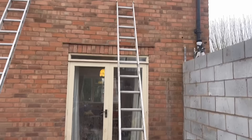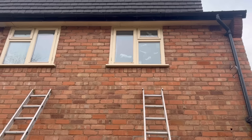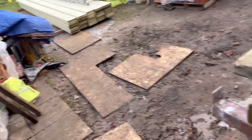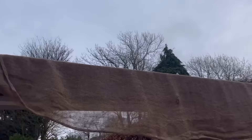Mick's just set the ladders up. We're going to start up here first. We're going to go to roughly the middle of the third course down from the windowsill, just so we've got a good upstand for our lead work and to fit our venting. The reason it's 9x2 is because when we cut the 8x2, the plumb cut on the rafter is going to be about that length — you need to have full bearing on your timber where possible. So 9x2 plates on the wall, screwed on for now.